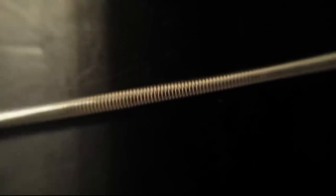And underneath here, you can actually see those wires pretty much in parallel. And there's some minor twisting that happens, but for the most part, by supporting the wire that's already been wrapped up with your finger, and then trying your best to avoid having any pressure on that core wire, all those core wires are going to be prevented from twisting too much, because as we hammer this out, it's going to actually straighten that wire. It kind of untwists and gets straightened as you hammer it.